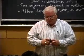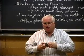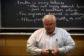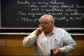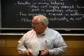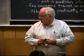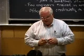But this one, well, it's bicrystal now because they took an electrical discharge machine and they basically sliced this thing. They call it filleting in the industry. This turbine blade, if it was a good one, and it's not a good one because it's got a corner ground off, and that's typical of a turbine blade that's been rejected. So no one will put one in an engine that's been rejected in inspection. They grind a notch on it somewhere. So anybody installing these things, if there's ever a corner or a notch ground in it, knows that's a bad one and don't put it in the engine.